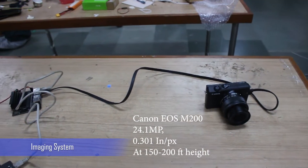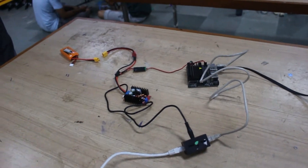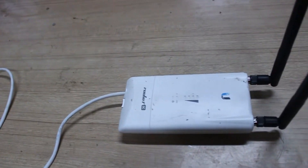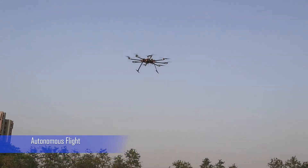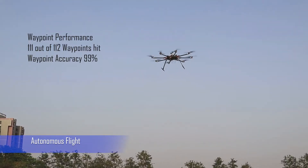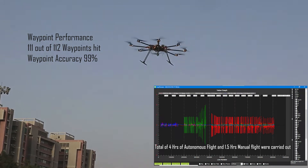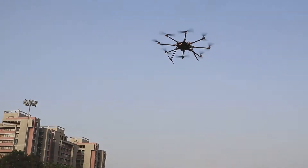The main camera is coupled with the Jetson companion computer. The imaging system handles image capture, geo-tagging, and file encryption. The photos are then resized and transferred to the GCS via the Ubiquiti Wi-Fi link. After meticulous testing of the autopilot, the team successfully performed auto-tuning of the UAV to get their PIDs well-tuned, achieving reliable takeoffs, cruising, and landings to ensure safe flights in extreme weather conditions.